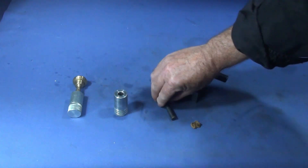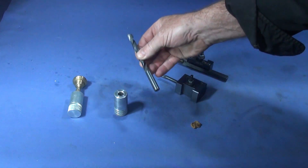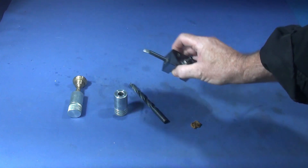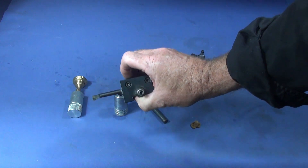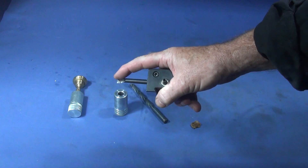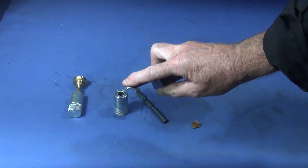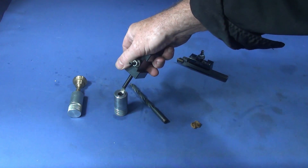To get the mirror finish in the bore, I drill then use a flat bottom drill, and that leaves about seven or eight thou on the diameter. Then I use a very long boring bar which I got off Banggood in a set — I modified this one, just ground off the back and the underside so it could actually get into this small hole.